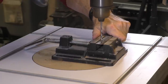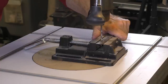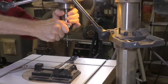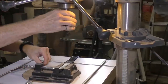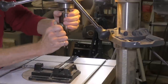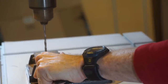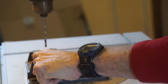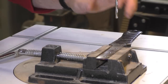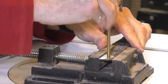While the scales are soaking in the resin, I'm going to drill the holes in the tang. Brandon had already drilled them to 9/64ths of an inch and I need them to be 3/16ths of an inch, so I'm going one drill bit size at a time to ease into the holes. The pin actually fits quite tightly, but that's what I want — I'll be able to hammer it in when we're ready.